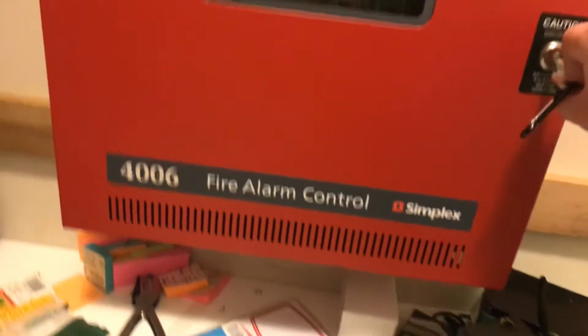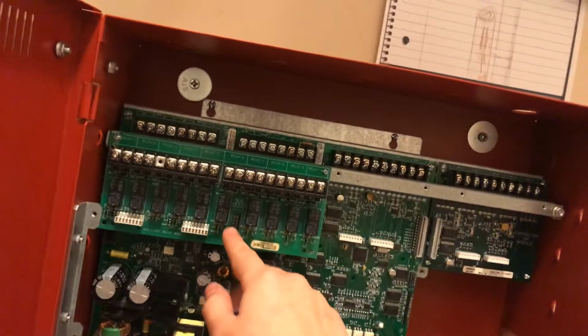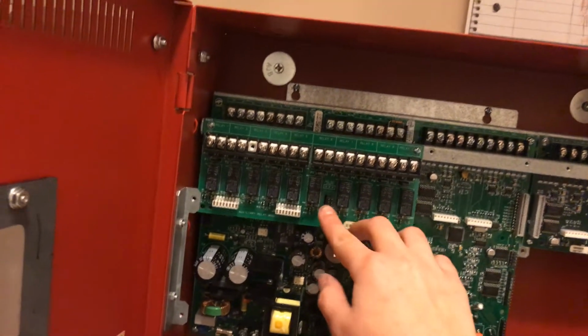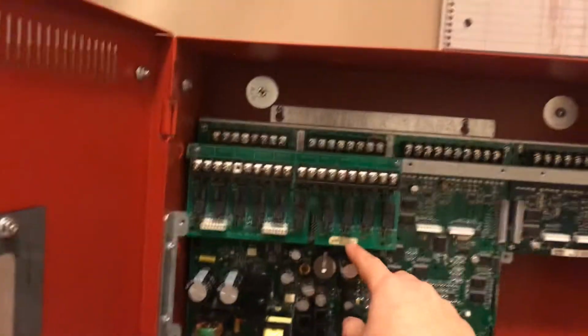And also, I meant to say this, but about the smoke and heat detector being hooked up to the same IDC, if I do something like that, let's say I was going to the panel and programming it in. I would program in a name, like basement smoke / heat, if that would fit. I doubt it would fit. I might be able to put in BSMT.